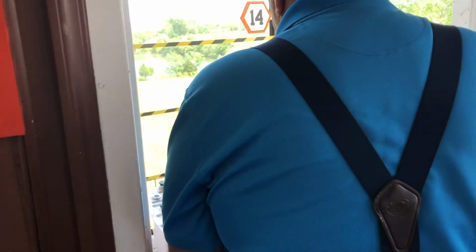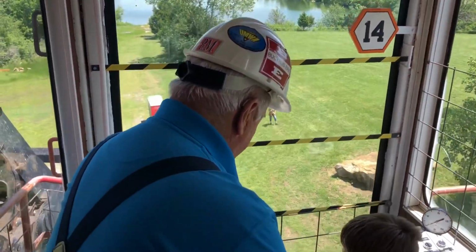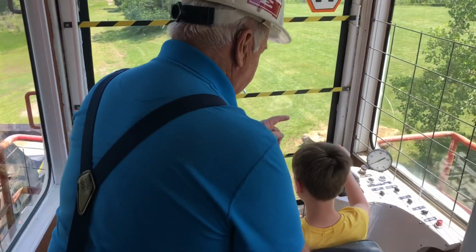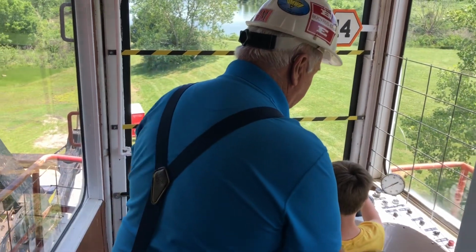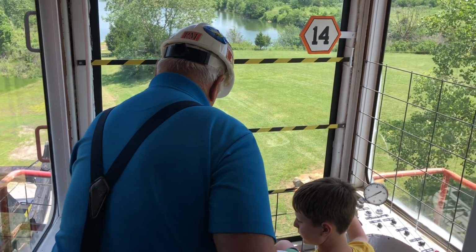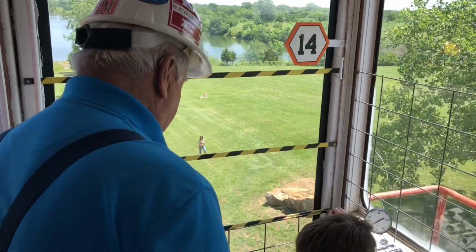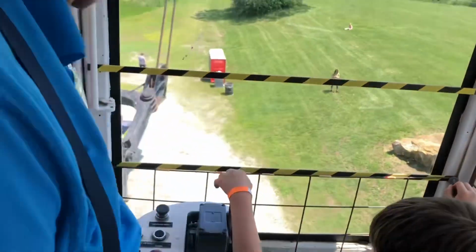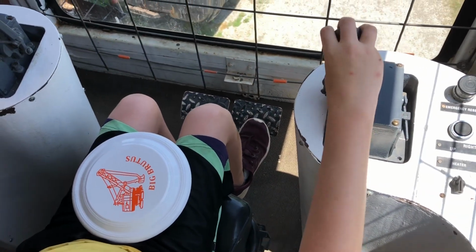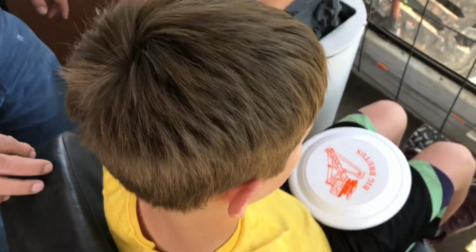An opportunity to see this is a person who actually ran the shovel. Yes. Here we go. Put these in center, right there, straight up and down. Okay, the air's off, so somebody left the air off. But here's the brakes. You release the swing brake, the crowd brake, and the hoist brake, and you blew the whistle real loud with that thumb over there. Squeeze that thumb. That blew the whistle. You look around, everybody's out of the way, and you started digging.